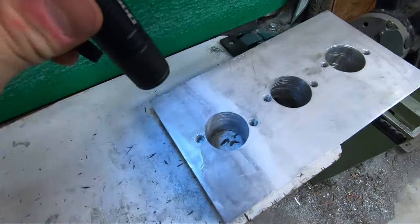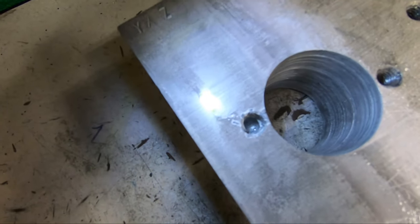So it's been a long day and we're still not quite there with the tap yet, but it has made significant progress. So pull the block out and you can see maybe some of the bubbling down in there. So this is definitely working. It's definitely dissolving the steel, but it's just slow going and I ran out of alum. So I'll need to get some more and put some fresh water in, come back another day,